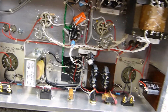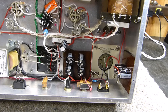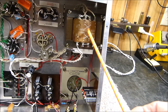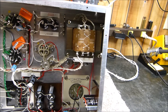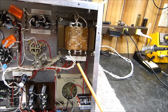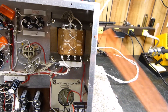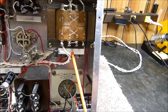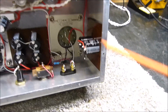The power supply — I've got capacitors in series to make sure I have plenty of voltage rating. There's actually 400 volts on the plate. This is the filament transformer — 6.3-volt dual winding. I've got a 100-ohm resistor in the primary that drops it to about 5.25 volts AC. It's got a 220-volt primary so I put two 120-volt primaries in series to get 240, dropping the 12-volt secondary down to 6 volts, and then the 100-ohm resistor brings it to just over 5 volts — which also acts as a bit of a shock absorber.